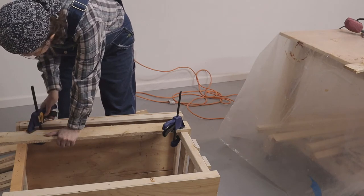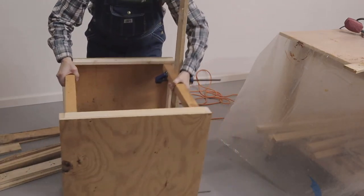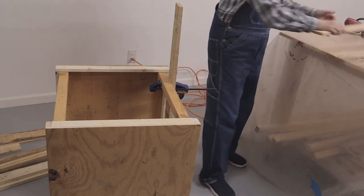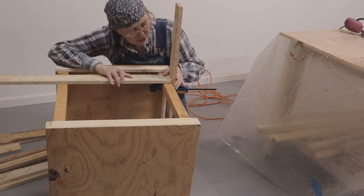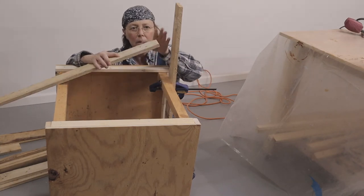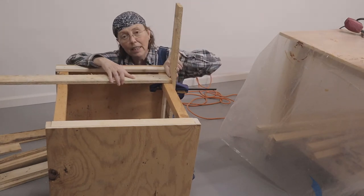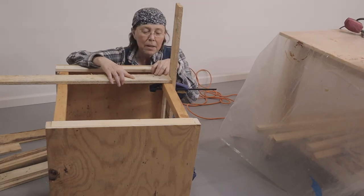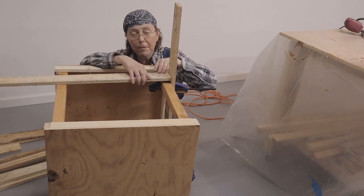Actually I'm going to do it from the inside. Alright, now I'm going to turn this over, and of course up here is going to be our door. So I'm going to put the door board in here. If I want this to look the same front to back, I'm going to want this to overlap or come to the top edge of where this board is. So I'm going to put that there and just mark this board — that's where I'm going to cut it. That's a real easy way to make sure I have that same look, so I'll have the rough edge coming in line with the top of this.